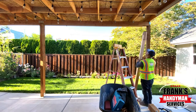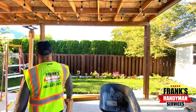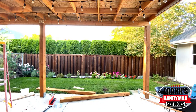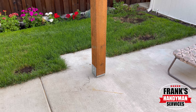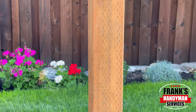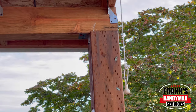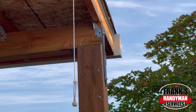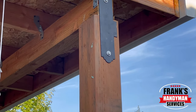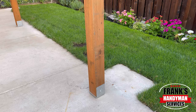We're using that with the wooden post right there. And then on top with the jack, we're lifting it up a tiny bit — enough to remove the old one — replacing it with the new one. We're replacing the brackets there at the bottom, securing them to the concrete. And then also at the top, we're putting a couple brackets there so it attaches the new post to the wooden beam at the top. Look at how clean and beautiful that came out with that bracket there at the bottom. This post is nice and thick, 6x6, super strong, very durable. This is definitely going to hold up all of that weight. We have a couple of brackets right there on either side of the post that attaches it to the upper beam — a nice heavy-duty bracket that attaches to each one with the screws. And then we also have the bracket there at the bottom attaching to the concrete.